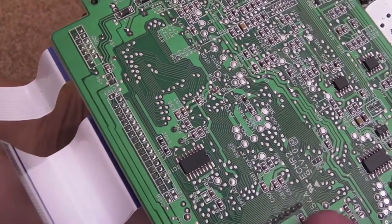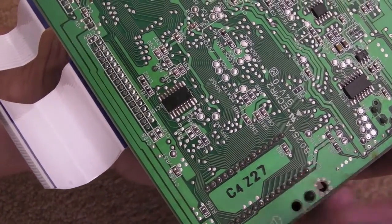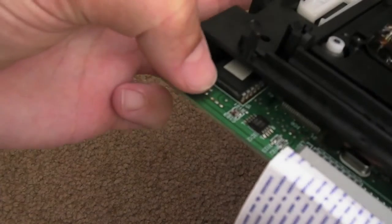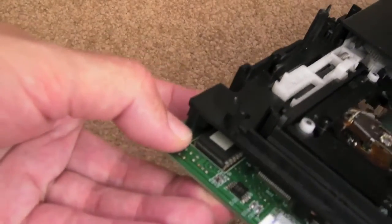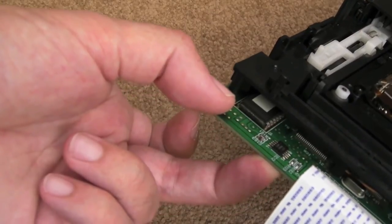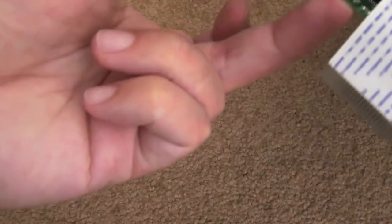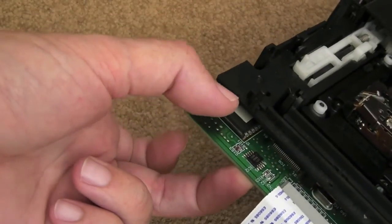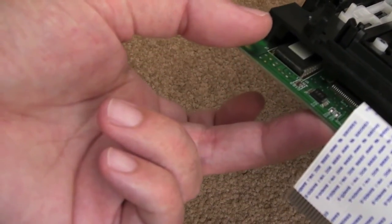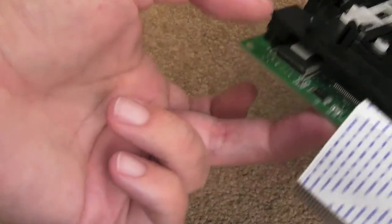There's nothing particularly unique about this drive, but it's got an EEPROM socketed here — a very slim line socket, almost flush with the board. You could probably take that off and reprogram it. That might be a fault on one of these drives in years to come — you may find the drive doing really weird logic things or not doing anything at all. Might be worth looking for a ROM for that. EEPROMs can run for quite a long period of time but ultimately they tend to just lose a bit here and there, so I wouldn't be surprised if the EEPROM becomes an issue on some of these drives in future.